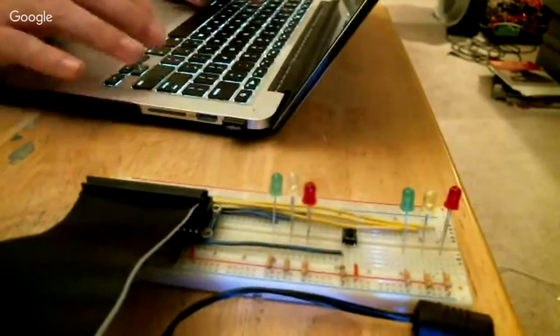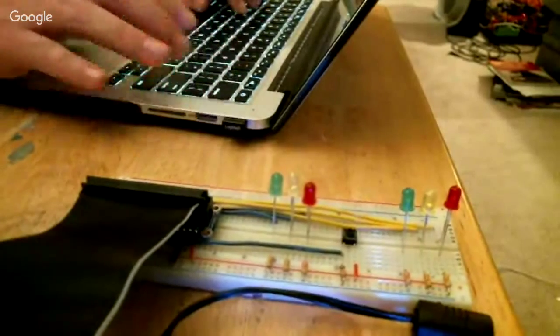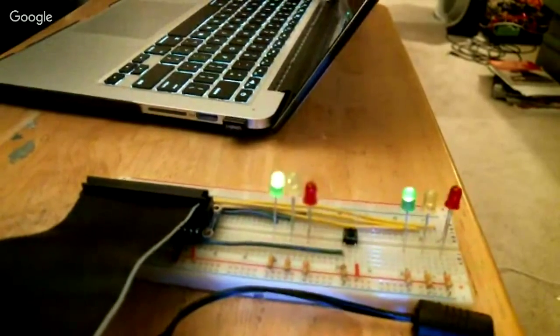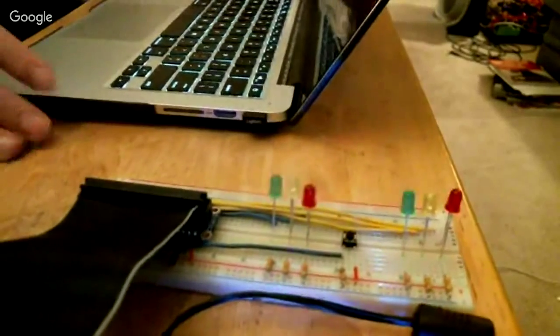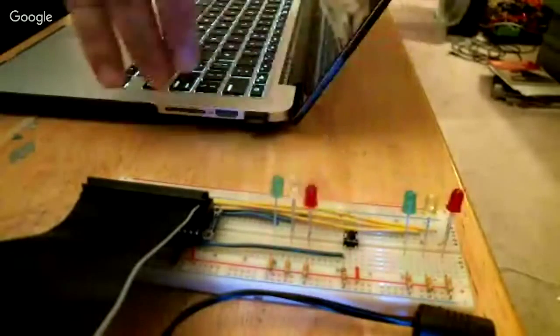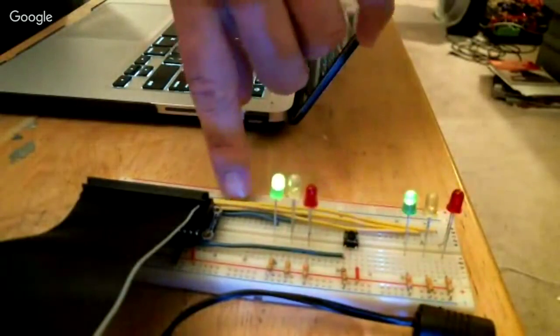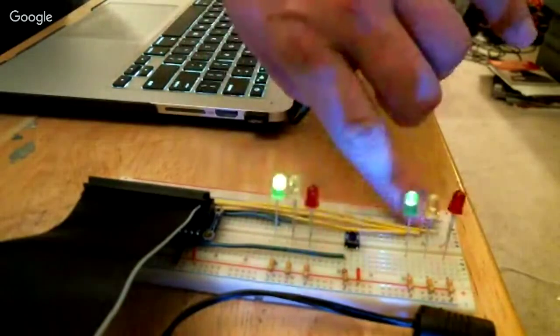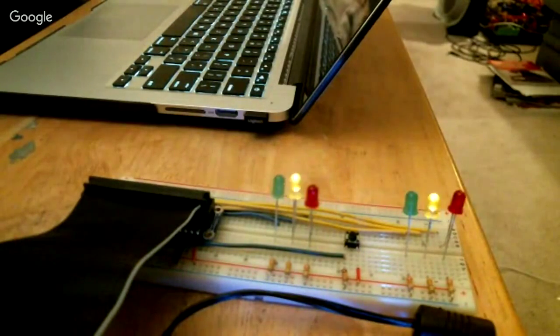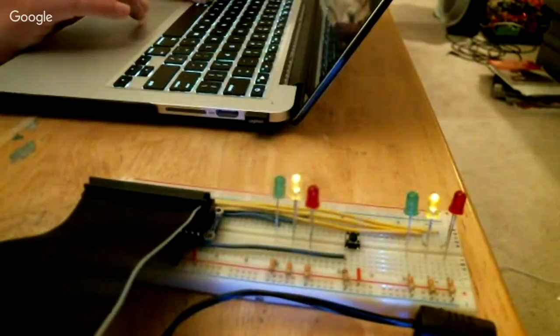Now, as far as your board, is it wired up similarly to your breadboard, in a similar way to what Craig was doing the other day? Yeah, and I would tell you to look at his Fritzing drawing rather than mine. I haven't completed mine yet. I have this header on my drawing that he does not, but it's got the same resistors, the same switch, the same LEDs. What you can't hardly see here is I've got 3 green wires going to the first light, 3 going to the yellow. Then I have one wire going back to an input pin, which we'll use in a second. And so all those are very simple things.